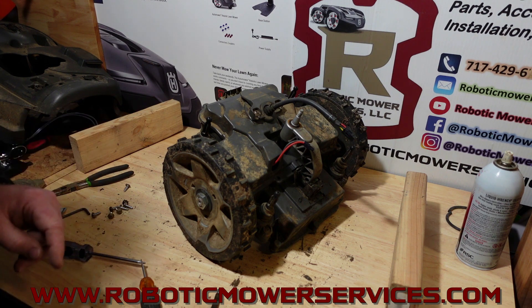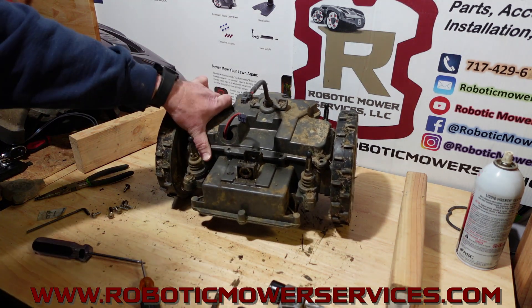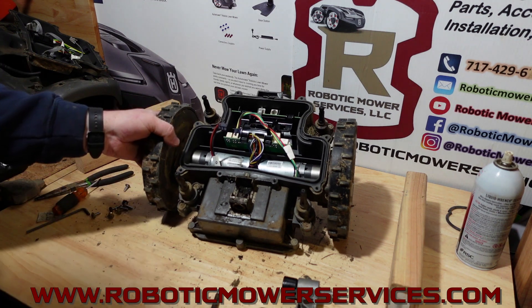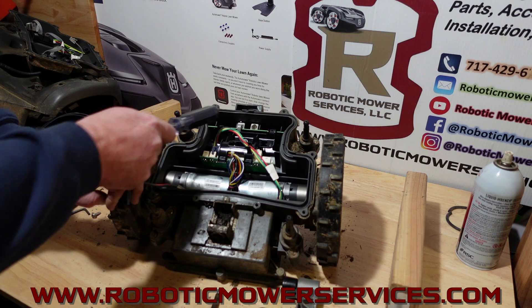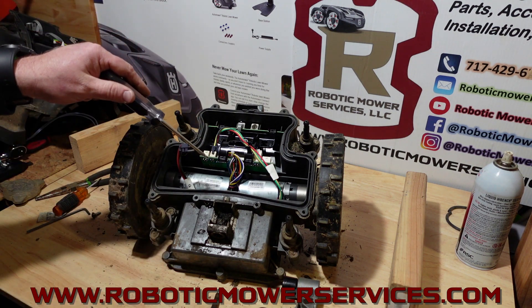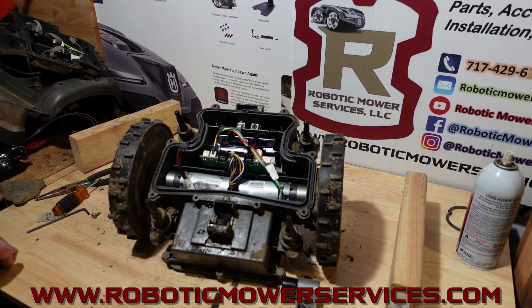Many of you have seen that because either you did it or your dealer did it — they put it back together and didn't go into AutoCheck to do a post-assembly calibration. You should do that whenever you replace any of these boards in one of these all-wheel drives, but especially the magnetic sensor boards or any components with magnets in them. You will also have to use AutoCheck to update the wheel motor control board right here, and calibrate your loop sensor board back here as well. Note that the loop sensor board back here is slightly narrower than the one in the front of the mower, so one from the front will not fit back here.